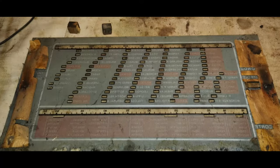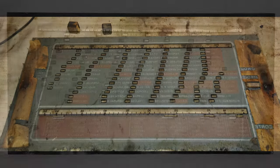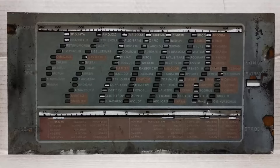The printing on the dial glass was in precarious condition. Therefore, it was cleaned without even removing the dust where it was unnecessary, and then it was sprayed with a clear lacquer to stabilize it. Later, when the clear lacquer was dry, it was sprayed with black paint around the borders, using appropriate masking. These are the steps.